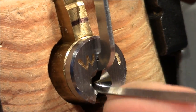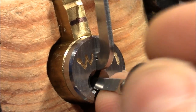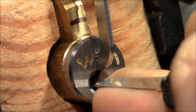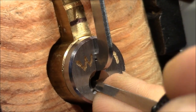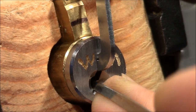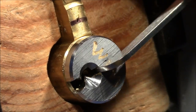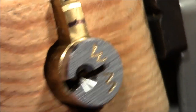That was good — plug returned and turned a little bit further. So we definitely have at least one T-pin inside. Good counter rotation — that's definitely a spool, maybe on pin two. It's really hard to set. Maybe I could set it now... and it's open! It just took me approximately five or six minutes and a broken pick.